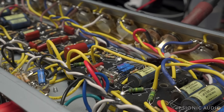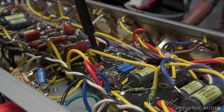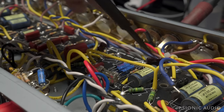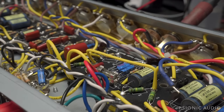That's what it is in most vintage examples. In this case, it was this generic SM-labeled silver mica 10 picofarad going across this 3.3 meg resistor in the mixing stage. That's the culprit, and I think I've got a good quality ceramic on hand, and I'll talk to the owner, see if he wants me to replace all. This 500 picofarad CDE can stay, but these are 220 picofarad or 250. These are generic. These are not good things to have. They always cause problems down the road. Now would be a good time to change them out.